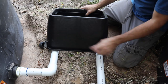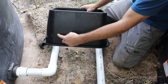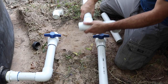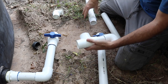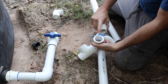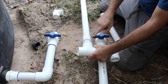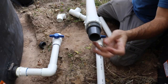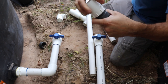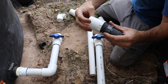We're making progress, but our sprinkler cover doesn't have any openings for the pipes on the side — it's really hard to find one that has everything you need for your project, so we're going to cut out some holes to accommodate our pipes. We're creating our U with a one-and-a-half to one-and-a-half to one-and-a-half T. There's a one-and-a-quarter-inch threaded female to a one-and-a-half-inch male slip that'll go in the end of the T, so we can screw in our one-and-a-quarter-inch pipe which connects to our poly. On the end of the one-and-a-half-inch pipe we have a barbed poly connector — that's one-and-a-quarter-inch poly barbed to one-and-a-quarter-inch threaded — and you need a female threaded to female slip adapter to go on the end of your PVC pipe.